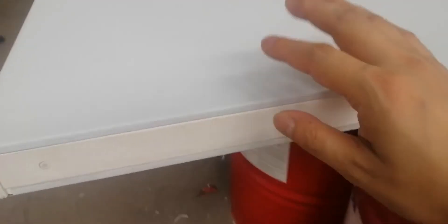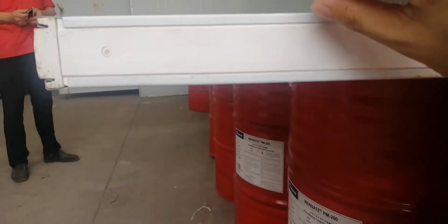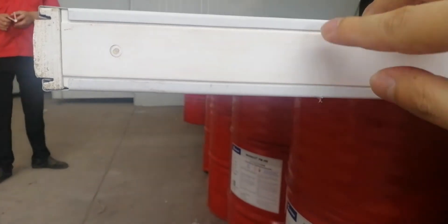This recess is one millimeter more than before, so this hinge pocket comes out from the door's skin and it's very straight. Meanwhile, we just cut one millimeter from this steel part.